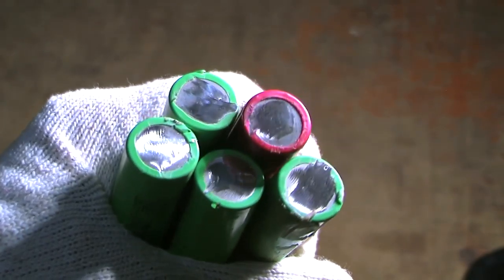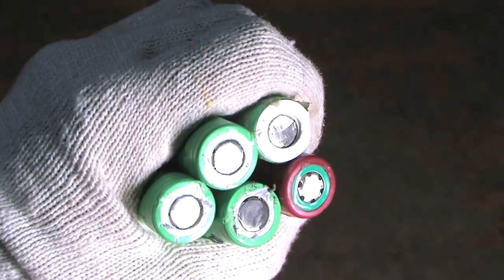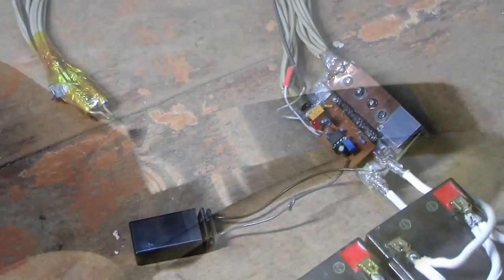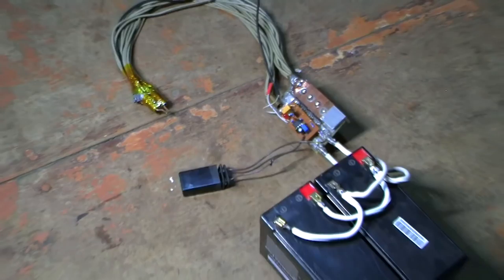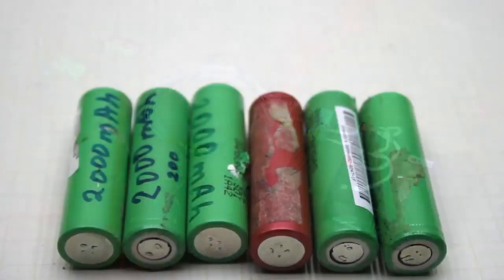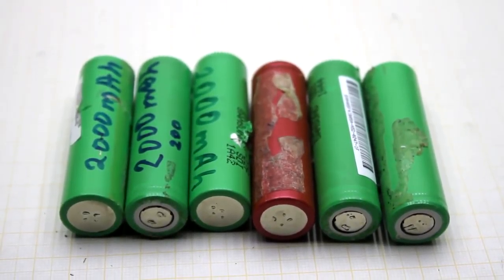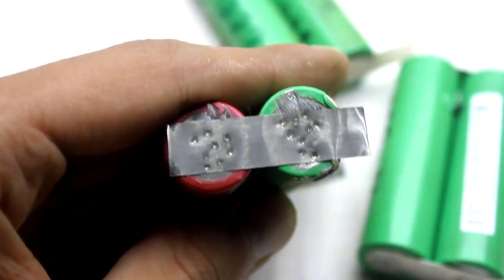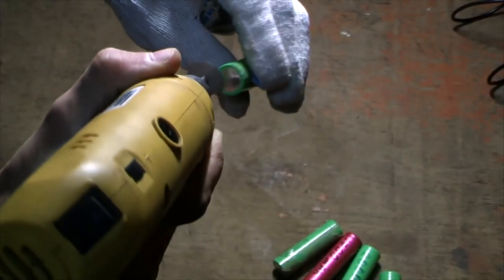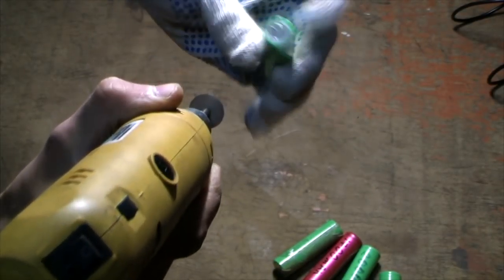The contacts of the lithium cans are prepared for welding. Then I cut off pieces of nickel tape and weld them with a self-made device for contact welding of batteries. Links to nickel tapes and the video in which I made the welding device will be in the description. It isn't desirable to solder accumulators of this type, and welding is the most accepted way of connecting them. Now look at the process of assembling the battery without comments.